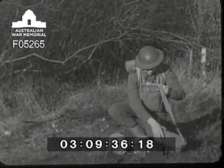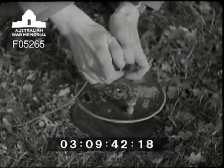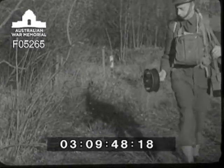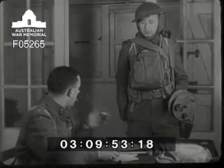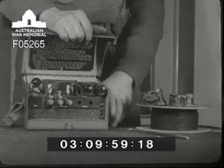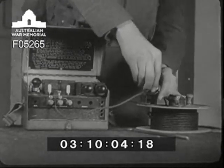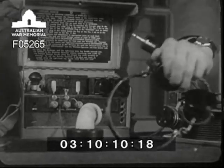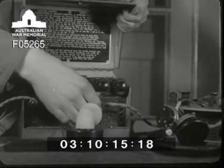That's the end of the first drum of cable, and now the second one must be clamped on. Remember, each drum contains 100 yards of cable, but allow for at least 10% loss in length when estimating the amount required. The remote control is connected to the cable and clamped up. The microphone and headphones are plugged in, and operator two puts a test call through to the set to confirm all is working.